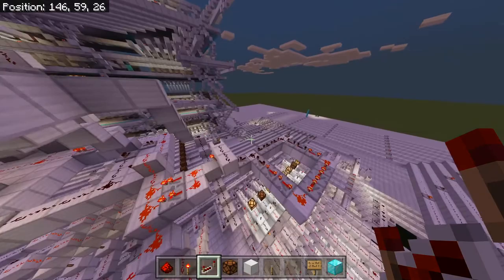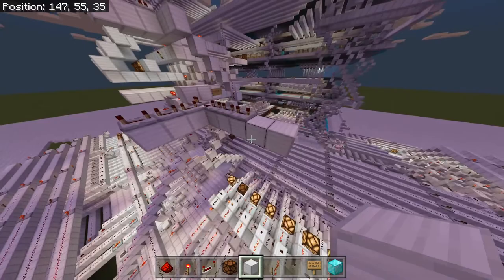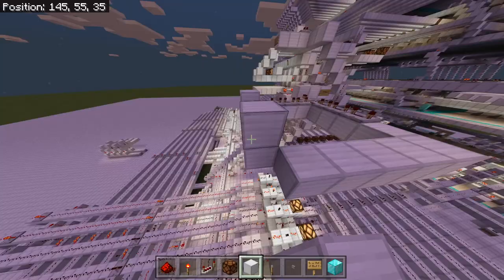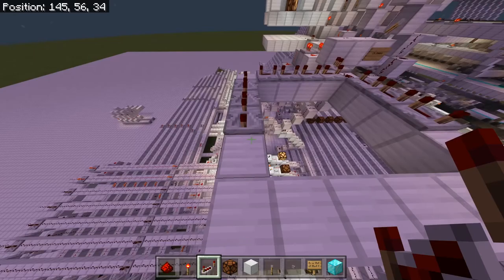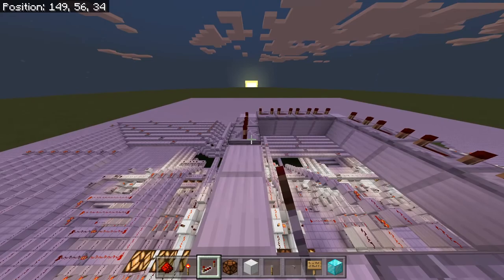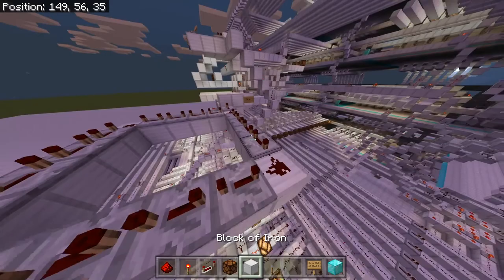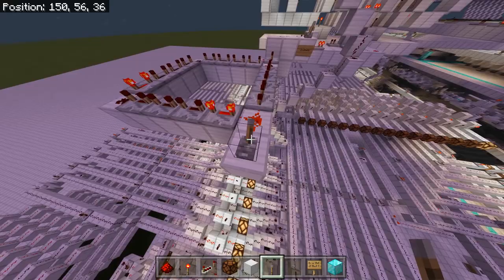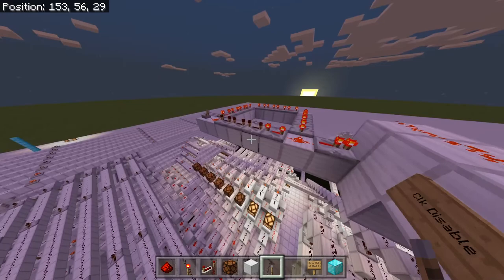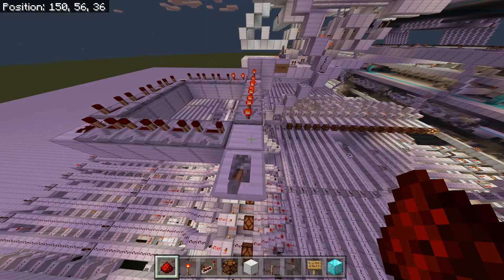That's not really okay. We need it to be less close than that. So I'm going to massively increase the delay here. Now, one of the other problems with a clock edge machine is clock skew. The data in one part of the system might update, and then the new data might race around and reach the part of the system that hasn't yet updated before it was supposed to. That'd be a really serious problem. Let's just try and get this clock set up correctly, because I've just done a bad job of it.